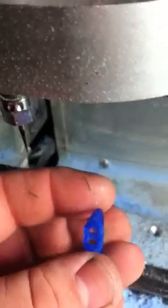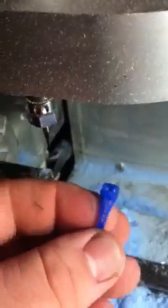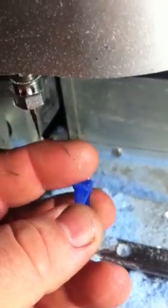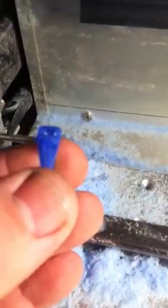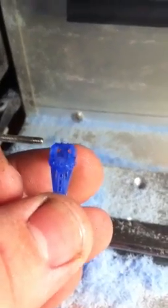We did a complete rotary on the outside, and then I indexed on the rotary to clear out these undercuts underneath of these pave strips.